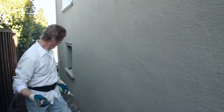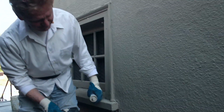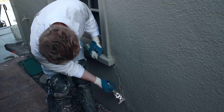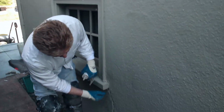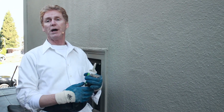One last thing. Okay, here's prepped also. And guys, again, no expansion joint. No expansion joint, you get the hairline cracking. Very typical, guys. If I was going to use stucco, I still fill this up with caulking, because caulking lasts a lot longer and it's flexible. If I just use stucco only, it'll pop back off the first time it starts, well, within a season or two. Anyway, when we get to that stage, we'll show you.